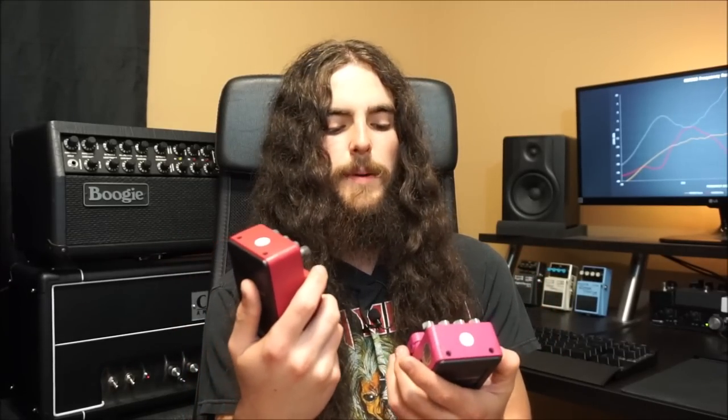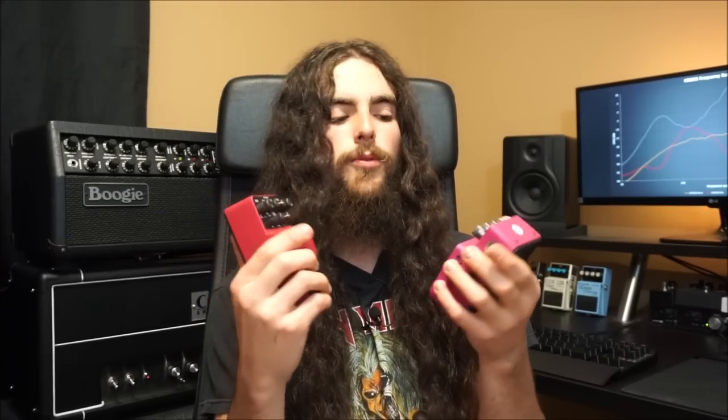Kind of weird things with this pedal. The HM300 doesn't have a lot of clean output headroom with everything at noon. So even if you crank the level, it's not that much above unity gain. And in fact, at noon, it's rather low. Distortion doesn't really have that much of an effect on overall output level.